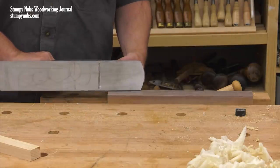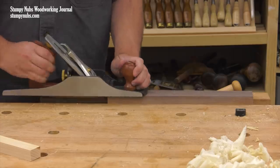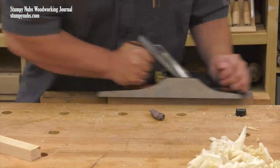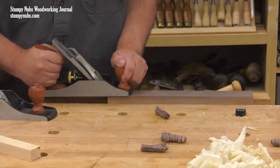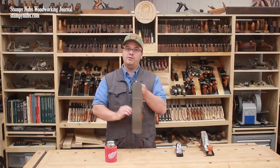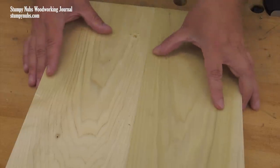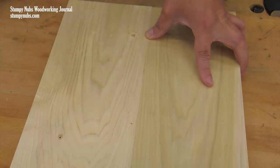This gives me a sort of runway to line up on top of my workpiece, squaring my plane and helping me to keep it flat as I'm entering the cut. That helps solve many of the problems encountered by casual plane users who have difficulty keeping their edges straight and square as they start, even with a block plane. The wider iron does make quick work of smoothing project parts if you do wish to reduce your sanding, but here's where it really excels.